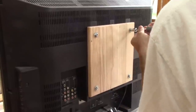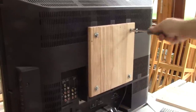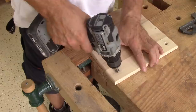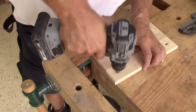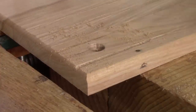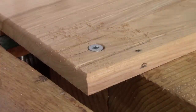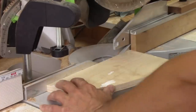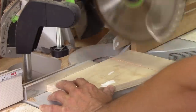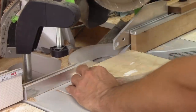When I'm done, I can try the back plate in place. Perfect! Now I need to take care of the other part. The first thing to do is to chamfer all the holes. I also need some sort of a hinge between both wood squares. I begin by cutting four strips to the same width from some scrap pieces of plywood.